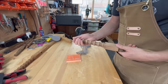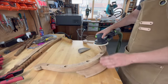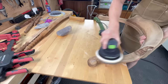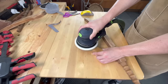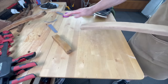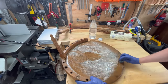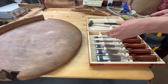You probably thought that with my new fancy machine I wouldn't need to do any sanding, right? I wish. I'm not really sanding because the finish from the sandblaster wasn't good enough — it's because I wasn't sure what it would do to the wood filler I just put in. I'm also using a foam pad just to make sure it was more gentle on the curved surfaces. The wood filler left a sticky, tacky residue so I had to remove it with mineral spirit before I sanded it.